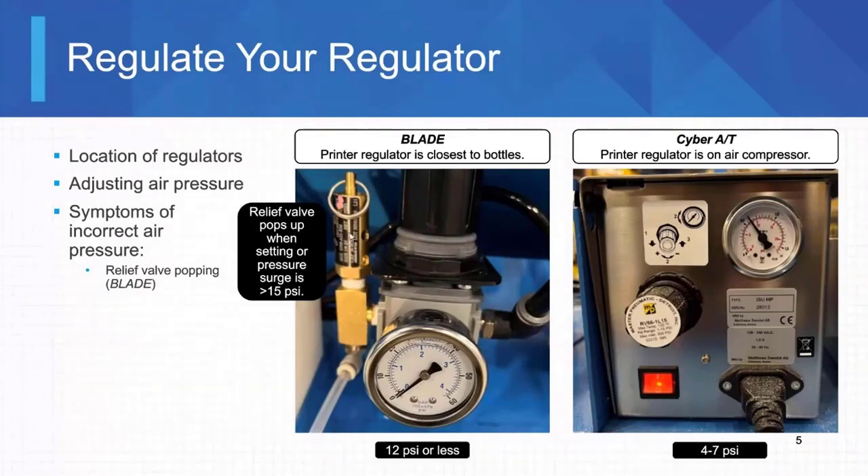This pressure valve is very important. It is set for 15 psi from the factory. When it hits more than 15 psi, this valve unit will pop up and you will hear air escaping from there — it makes a pretty large racket and a vibration sound. If that's the case, you can simply push down on the top of it. We don't want to push too hard.